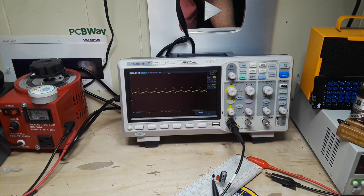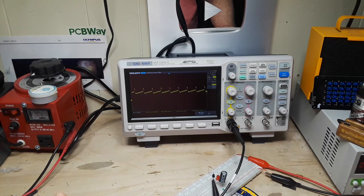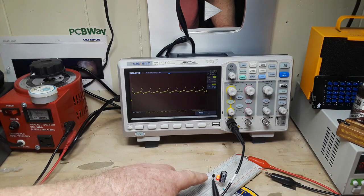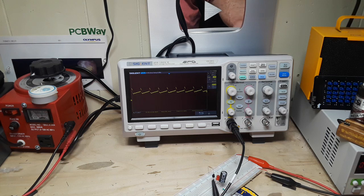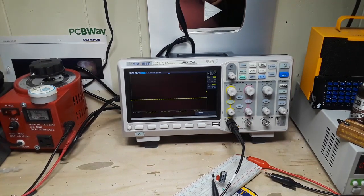Okay, so we just got to figure out, what are we reaching the breakdown voltage of? What characteristic of that transistor are we reaching the breakdown voltage of that is allowing it to fall into the region of negative resistance? Well, what is happening here? Let me energize that again. Like I said, we're entering a region of negative resistance. It's called the NDR region, negative differential resistance.